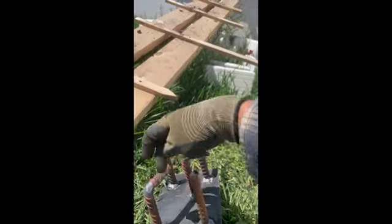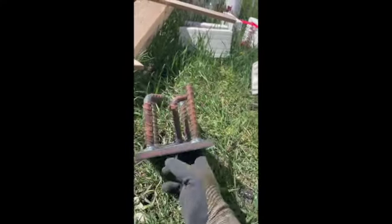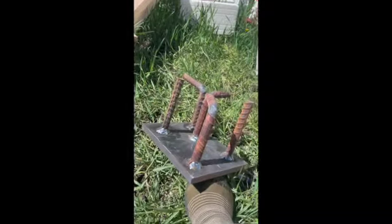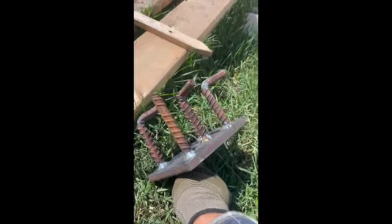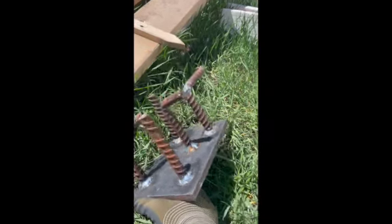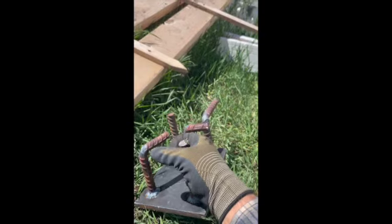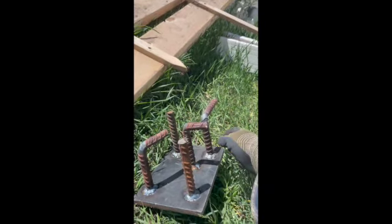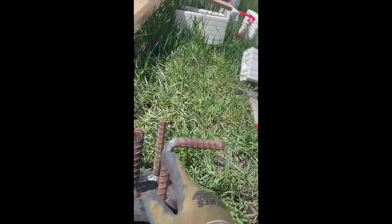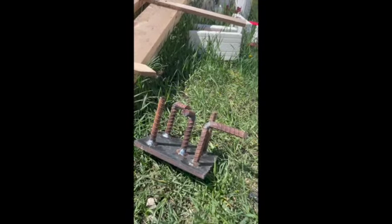I did some research and I found some ones that were the same size, but they only had 4 pillars. And they had outrageous pound shear force. So I think mine, they're uglier, but they're, I think, overdone. The ones that they did some test on were from the University of Alberta, and they didn't have L's in any of theirs. There was just straight pegs with a thicker head at the end, like a bolt. So I think that the L's, especially some of these big L's, I didn't cut any of the rebar. I just took some scrap that I had and measured up 4 inches and then bent it at a 90. Anyway, I'll put those on and we'll see what the engineer thinks.